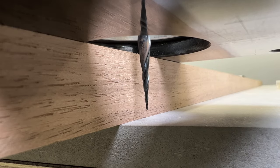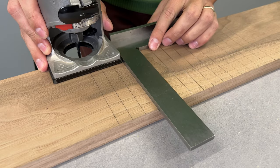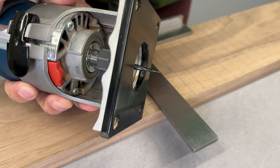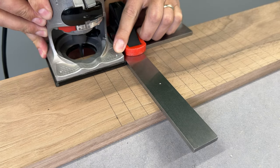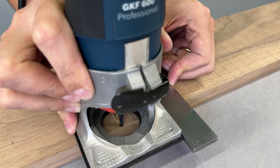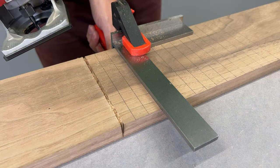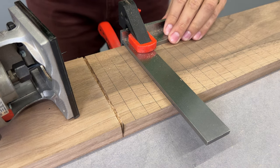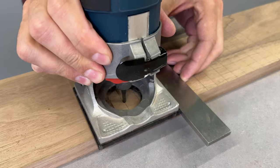I lowered the bit to have approximately 1 mm from the bottom. To get nice and parallel cuts, I used a square by clamping it in a proper place. This gave me a solid and straight reference along the cut. The process is quite repetitive — I'm clamping, eyeballing the right place, clamping the square back, making a pass with the router, and starting all over at the next line.